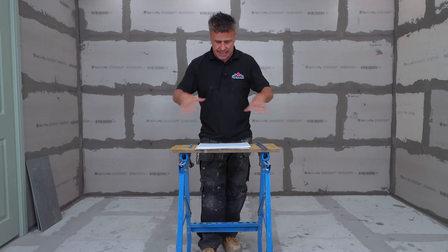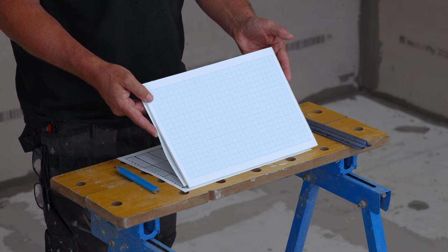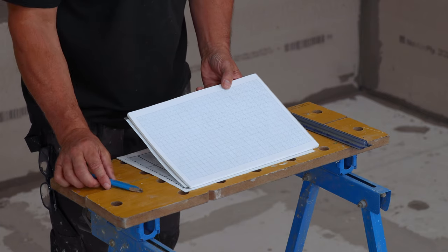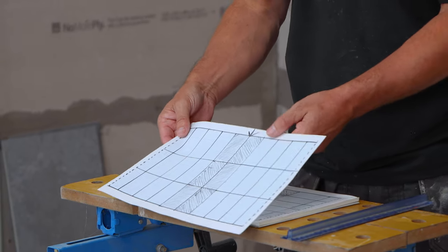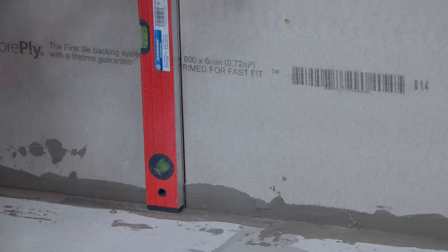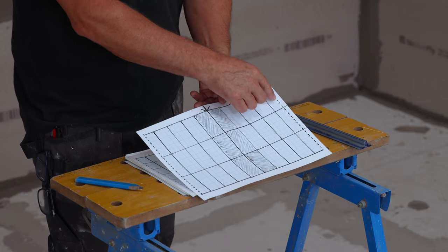The key to every successful project really is the planning. This bathroom I'm in — we were laying our tiles directly onto a wooden floorboard so we've put some cement boards down first and reinforced all the joints, likewise with our walls behind us. But planning also in the form of graph paper. Every square on here is 10 centimetres. I would always recommend you start from the very centre of your room and work your way out with full tiles — that will give you an equal cut on either side.